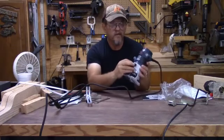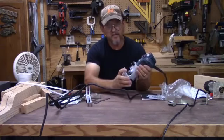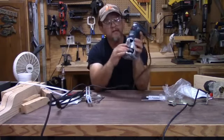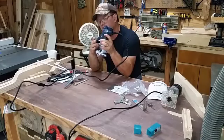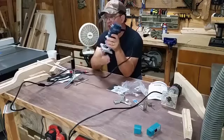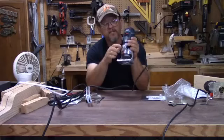When I first started playing with it, this was a little bit loose — when I tightened it down and locked it in place I could still move it back and forth a little bit. So I took a wrench out of my toolbox and there's a little lock nut right here. I just turned that lock nut just a little bit to make this tighter so when it clamps down on the base it's got a tighter fit. If you buy this router and feel the base is just a little bit loose after you lock it, you can adjust it with this nut.